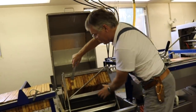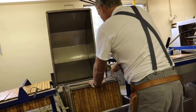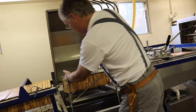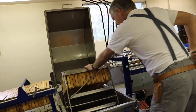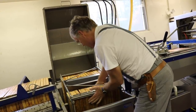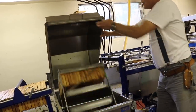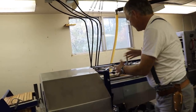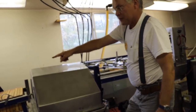The next thing we do is scrape the end bars — just scrape those down there. We get excess wax on that surface, so we scrape those off while we have them all held in position. It's really quite quick because we have pretty good access to those end bars right here. That's ready to spin now. Because these are not self-spacing frames, we give them a little bit of a wiggle so they're not stuck together. We give that a big pull, turn the switch on, and then lower our lid down. That runs for about 10 minutes, and while that's running we can uncap another load over here. The frames that have advanced out the outfeed rail can then be handled.